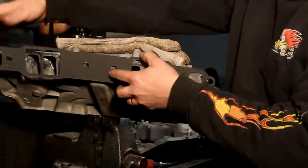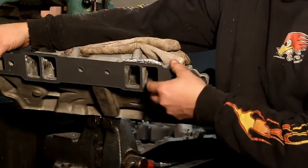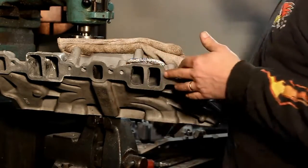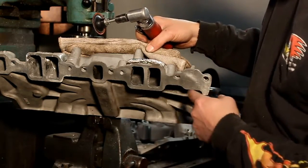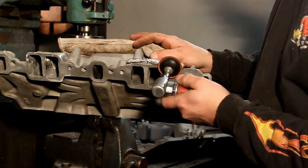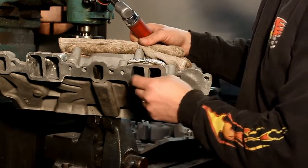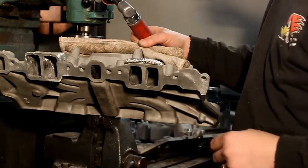Here it is welded up, and you can see the metal is up above the gasket now. It's amazing how quickly this cools off. Now I have this surface here that needs to be smoothed down. You might think you need to chuck it up in the mill and hit it with a fly cutter - that would be the correct thing to do - but I'm just going to take it down with this little grinder, then lay a flat file on it. The flat file will show you all the high and low spots, and if it needs more, I'll just build it up with the welder.